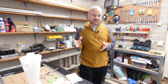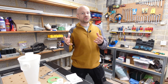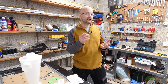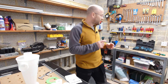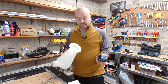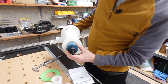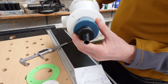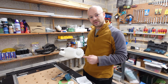From that point you can decide on what size hole saw you want. You don't want to go too small — in fact, you don't want to go smaller than the given size, but you can go a little bit bigger, which is good because I don't have one that exact size. My hole saw is very slightly larger. With these you also want to make sure that if you do go for a larger one it's not too big — it's literally just on the edge of the plastic, because if you go too far you're going to start to infringe on the seal and you're going to lose your vacuum.